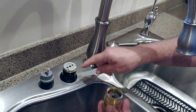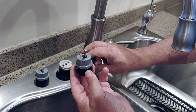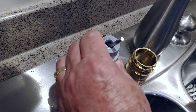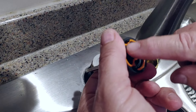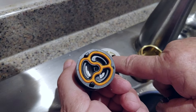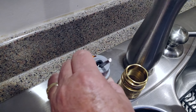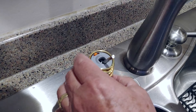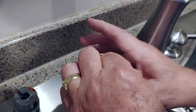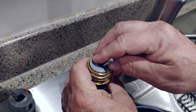Off comes the whole item. There's the base — leave that alone. You're simply going to drop the old cartridge out. As you can see, there are your two locator sockets that match up with the two locator pins — it goes right back in like that. All the integrated gasket is in place. You can only fit it one way: here's the hot inlet, cold inlet, and outbound to the spout. So we're going to put it in just like this, bring the bonnet nut back over the top, and screw that down — finger-tighten it down for right now. Make sure everything feels good, and it does.